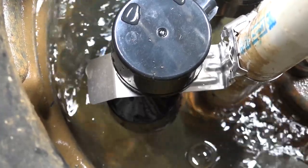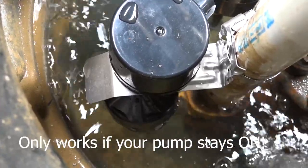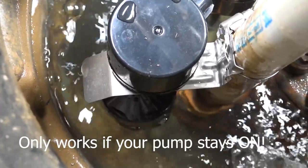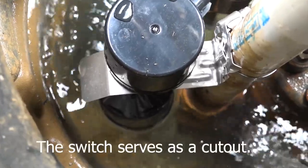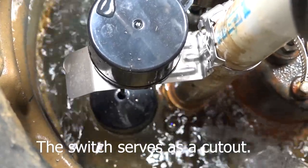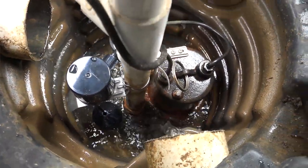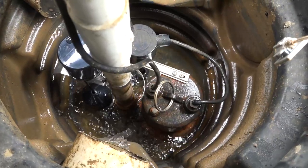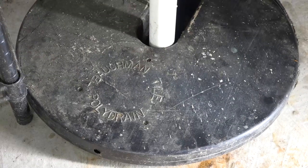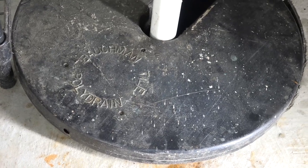And it works — it's about to turn on again, and there it goes. Satisfactory test — very happy with the switch, highly recommend it. That's a Superior pump with a discontinued switch. Why didn't I take out the old switch? You can see it's threaded right into the top of the casing with a gasket seal — we don't want to open a leak path, so I keep that closed. Don't forget to put your sump pump cover on. Thanks for watching, hope it was helpful.